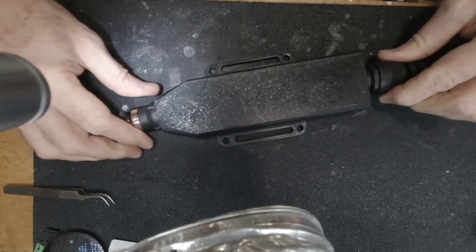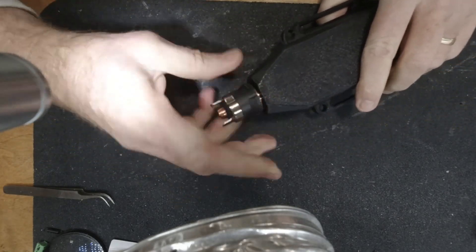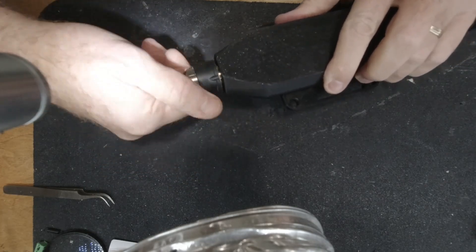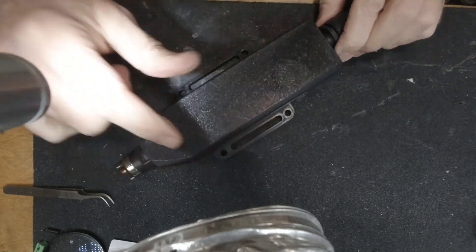The output cable is slightly flexible. You can still change the consumables the same way you did before, but remember there's no sensor to sense that the consumables are in place. So don't fire the machine without them.